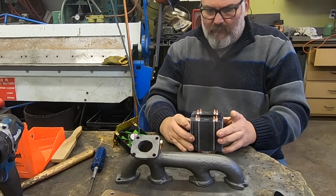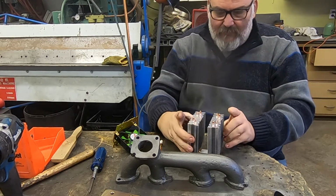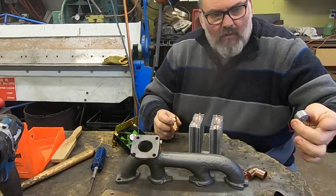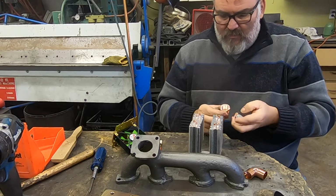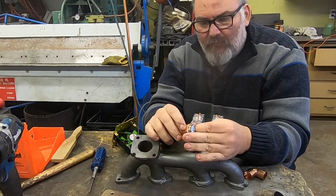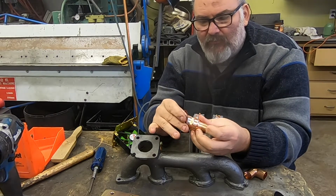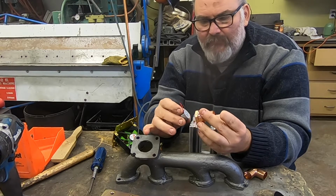And then as well as that, to mount the fan, what I do, use these copper fittings and then just clean up the threads a little with a die grinder so that the motor can fit in there, as well as groove out one side where the cable's going to bend back and through, and then that will slide into there. Just real nice and snug, and then that's all you need.